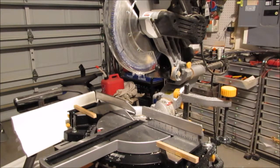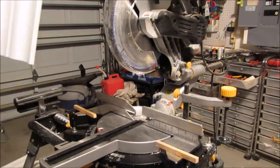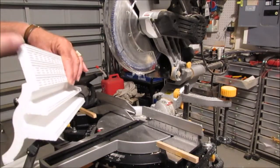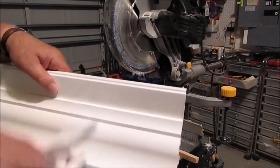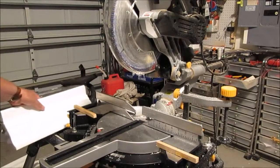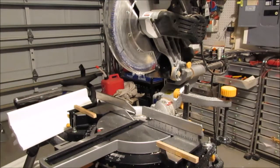And don't let anyone ever tell you that, oh, it doesn't matter, you can just do 90-degree inside joints on a wall, because it's not going to work out, because some walls are 89 degrees, some are 91 degrees, some are 91.5 degrees, and when you're cutting crown, it's as big as this, and this is what, 5.5 inches on the back side, but I think it's like 7 inches on the front. When you're cutting really wide crown molding like this, it matters. A half a degree matters.